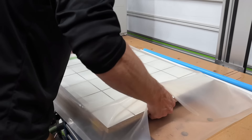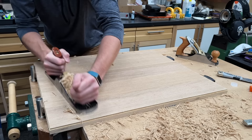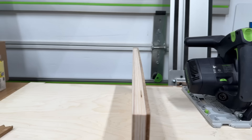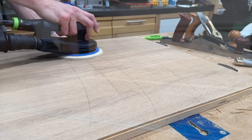About two hours later, I could pull this out of the vac bag. As you can see, sitting on the bench it's really not that cupped, but it's only been two hours and that PVA isn't quite dry yet. After a nice low angle jack plane session, I got that veneered surface all cleaned up. Here's a little cutoff piece showing the cupping — it's about a sixteenth of an inch. On a narrow piece, that doesn't really make much difference because you can flex it. But on the wider bottom part of this cabinet, I did run into problems.